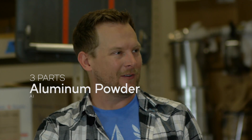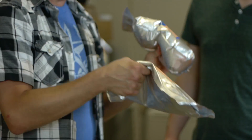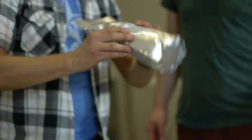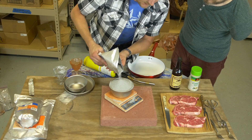There's a bunch of different recipes and each one will have a different reaction, but the one I learned is three parts by weight of aluminum powder to eight parts of iron oxide. In this case, we have three pounds and five pounds — so we have exactly eight pounds of iron oxide, now we just need three pounds of aluminum. This is five pounds of fine mesh aluminum. If we just take out two pounds, then we mix them all together and we're good. By doing bigger quantities, the rounding errors kind of blend out, because it's finicky stuff.